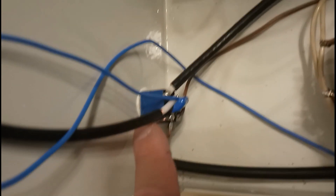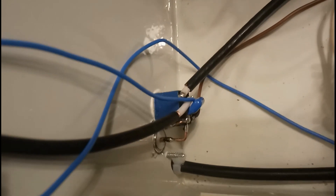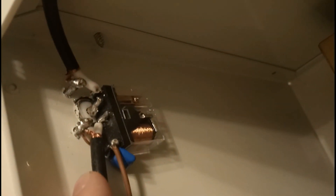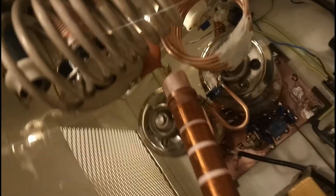On this side you can see a small transformer delivering 12 and 24 volts for the relays. Most of the relays are working at 12 volts. The input relay is here — it's a standard Chinese relay, it doesn't need to withstand high powers. Here you have the PTT, and there you have the antenna relay, which is an OMRON relay able to withstand 1 kW.